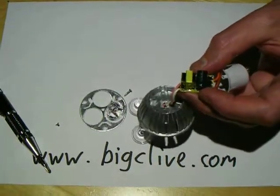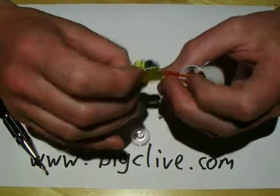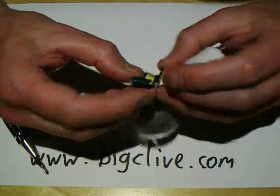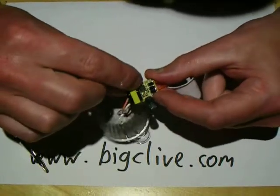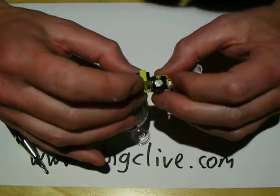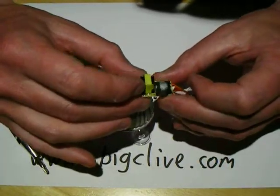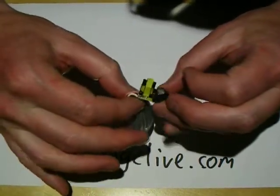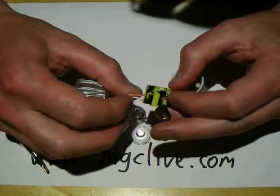And there's a very, very small switching power supply — current balanced. The mains goes in and into these four diodes, forming a bridge rectifier. There's a capacitor rated 4.7µF to smooth the mains supply. There's a switching chip which then drives the transformer. These transformers are usually isolated. There are a few surface-mount components, including some underneath the transformer. The output of the transformer is through that diode and a small capacitor on the other side for filtering.